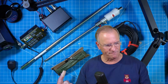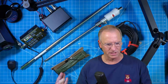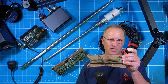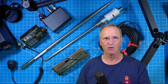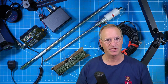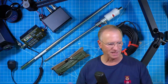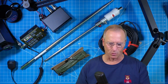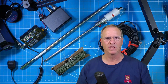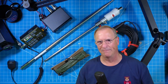Understand that the 60-foot wire that comes with it is Chameleon's 18-gauge PTFE Kevlar wire — this stuff is durable and strong. That's why you need something a little bit more lightweight to put on top of that SS-17. Don't go out and buy Walmart speaker wire and try to put 60 feet of it on your SS-17 — you're just going to bend that SS-17 over and damage it. You need something lighter than this 18-gauge wire, which is why I'm recommending this lightweight 26-gauge wire. That will give you incredible flexibility in this kit.